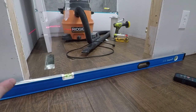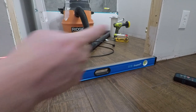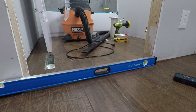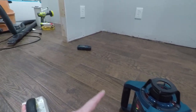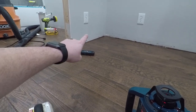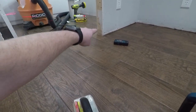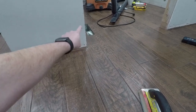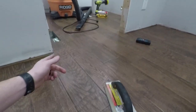One way to do it is to put the end of your level at the corner of the door, raise it until it's level, and measure the height difference — you'll want to know that measurement. I also have this rotary laser level; you can see the line is pretty consistent in person, it just looks splotchy on camera. I can take a tape measure, measure from the bottom to that line on both sides, subtract the difference, and get an exact measurement. This works pretty good, but the next method is better.